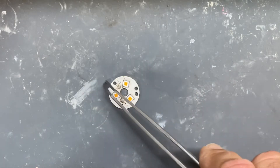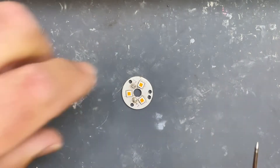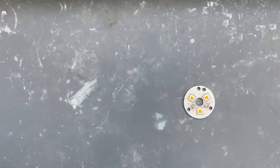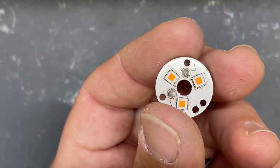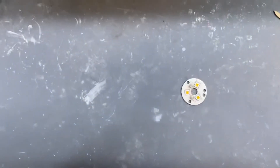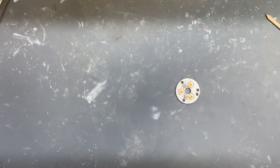Alright, I'm back — hopefully this is the same video and not a second one. I cleaned up the board a little bit. I just use a toothpick and you can kind of scrape all that stuff away, then a little bit of alcohol cleans it up well. One thing I forgot to do earlier was check continuity to make sure de-doming didn't affect anything. I still got power, so that's good. Another thing I was doing was wrapping a paper towel around my finger and gently with my fingernail right on the glass — least abrasive as possible — and the glass is clean. You should be good to go.